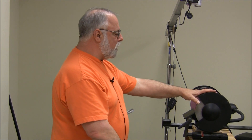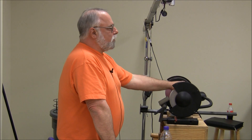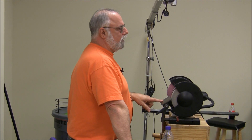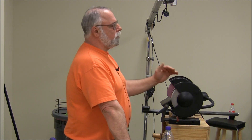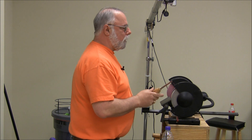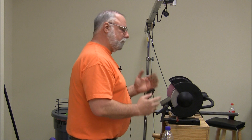When you mount the grinder, every manufacturer has a different spindle height. Runway gives you a set of specs on how to set up the spindle height above the extrusion — do it properly. They also tell you to have the extrusion align with the center of the wheel — do it properly. It's all geometry. If you understand that you've set it up correctly, all the geometry will work and you'll get nice grinds. So we've got a grinder, we've got wheels, we've got a jig — we're ready to go. Or are we?